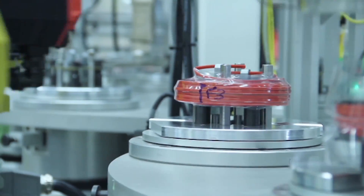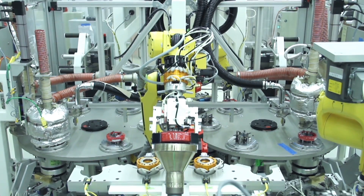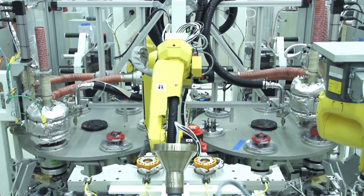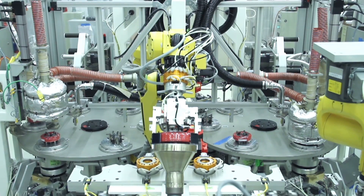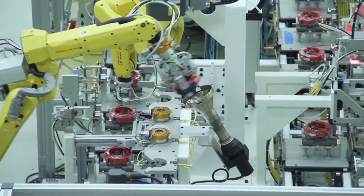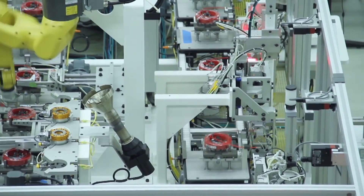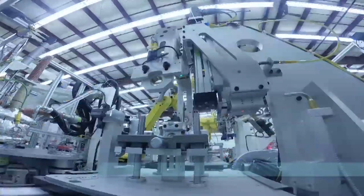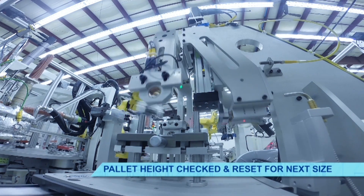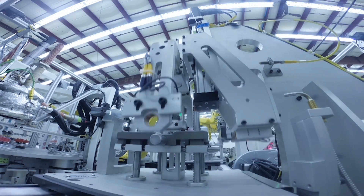After the coils are wrapped in plastic, they are moved to the FANUC M10IA robot. The FANUC M10IA robot picks a coil and presents it to a heater. As previously mentioned, the system handles six different lengths of wire assemblies. Therefore, each pallet needs to be automatically adjusted to fit the proper coil size. To do this, a height sensor relays information to a servo, which sets the appropriate pallet height for each individual coil.